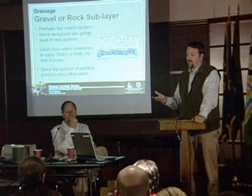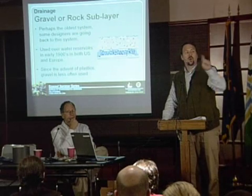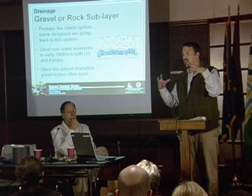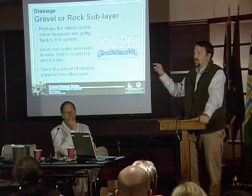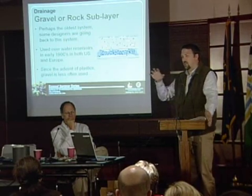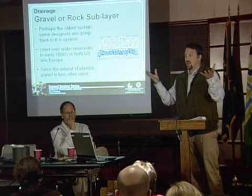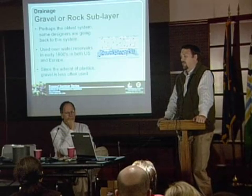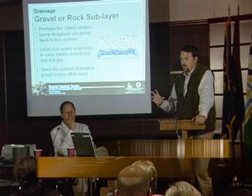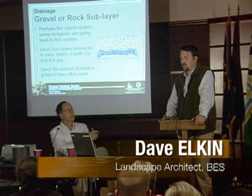Well, we don't know. There are definitely some systems out there where they'll do maybe 1.5 inches of growing media, and then maybe 2 inches of an expanded clay or a higher aggregate that will drain that water faster, but also create that water retention layer. So that's where there's a lot of that dichotomy between getting rid of that water, being able to shed it, but then also having that layer hold on to that water as well. So I think gravel layers obviously move that water through, but maybe there are other aggregates out there that can be used that also hold water.